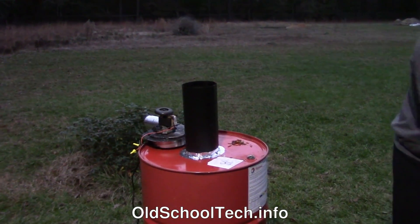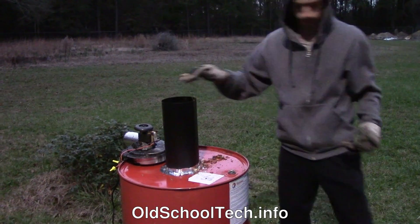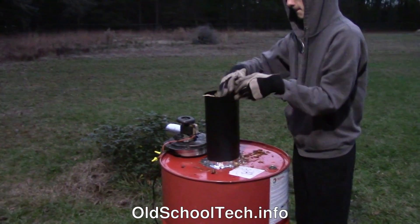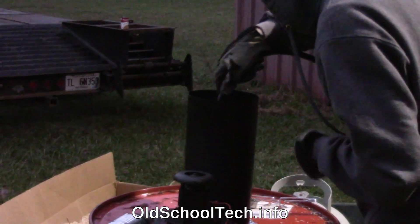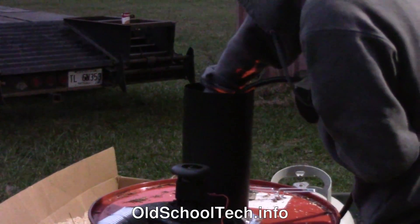At this point, the pyrolyzer is ready to go. Here we are loading it with some wood chips. For the first firing, load it about halfway up the stove pipe with chips, and then throw in some dry sawdust or chainsaw shavings. To light it, turn on the blower and then hold a propane torch down in the hole. You'll see how fast it catches fire, and then the flame front will move quickly through the fuel.